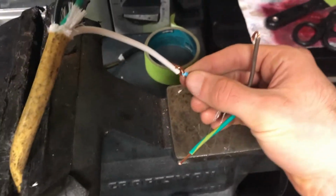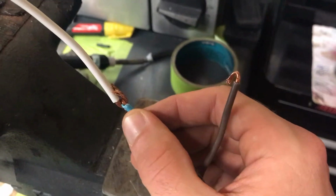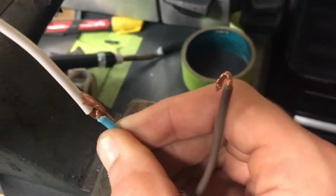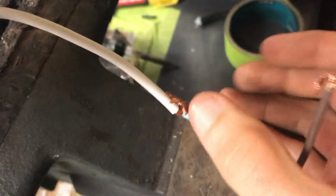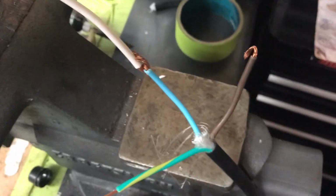The other key thing to make note of when you're doing the soldering is if you need to desolder something, there's something called a solder wick, and solder wicks look a lot like this. They just soak up the solder as you heat up the wires. The trick to this is heating up these copper wires and then you just flow in the solder, and it should absorb all the liquid solder when it's in the liquid state.